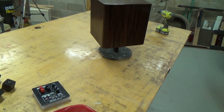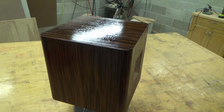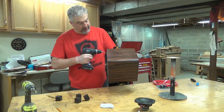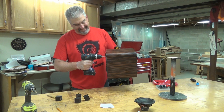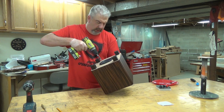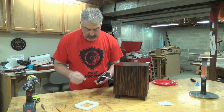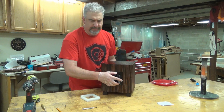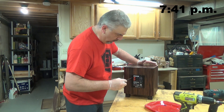The poly had just enough time to stop being sticky, and I was quickly running out of steam, so I took the enclosure to the basement and prepared for final assembly. The poly was actually still a little bit sticky, so I held the enclosure while I installed the feet and then the driver. Then I could relax a bit while I installed the amplifier. I shoved a basketball-sized wad of polyfill in the cabinet before placing the amp, just to quiet down any reverberance in the enclosure. Then I shot a few number 6 screws into the pre-drilled holes to mount the amp — and done!